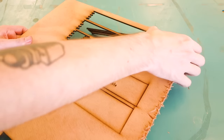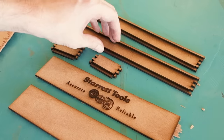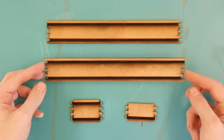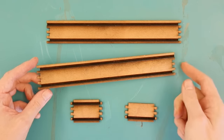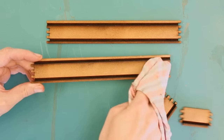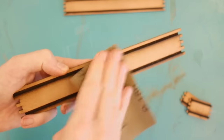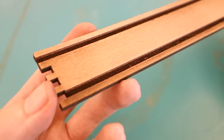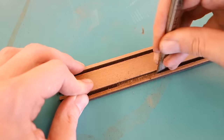Now with all our pieces cut out, it's simply a matter of applying what we have learned so far. Depending on your wood, and especially how dirty it is to laser, you may have to prepare the pieces before gluing. Unfortunately my plywood is very dirty and covered in soot. Wiping off what you can and giving any surfaces that will be on the inside of the box a light sanding is definitely a good idea. The grooves we etched also need to be cleaned out a little bit — scraping them out with a chisel works well to smooth them out and get rid of the excess soot.